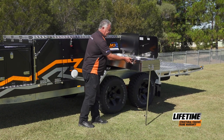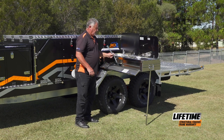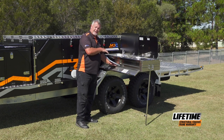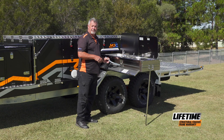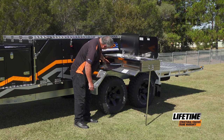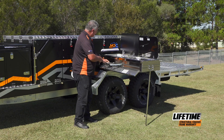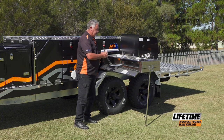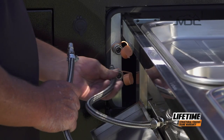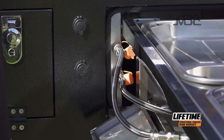In this front cupboard, if you lower that down, you'll find your hoses and connections. One hose is the drain hose for the sink. Run that out the hole in the bottom of the kitchen and into a jerry can or a bucket, and that'll collect the wastewater. For your water, your hoses are underneath here. Now these are a snap fitting, like a Nitto fitting. Just plug it in — cold at the bottom, hot at the top. They're ready to go.